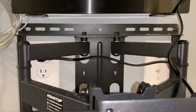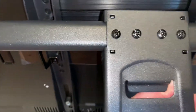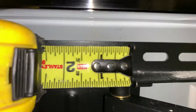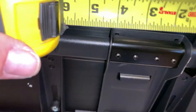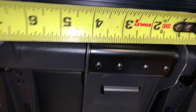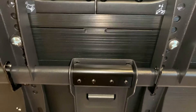I'm going to push my mount off to one side because I want the center of the wall. If I turn it around when I put the mount on, I want it off to the right-hand side — that pushes the TV to the left. Sounds backwards, but if you look at it from the front, it does what you think it does. I'm going to take my tape measure and measure from my wall marking to my center TV marking — about one and a quarter inches. My gap on the back of my mount is six and a half inches, so the middle is three and a quarter inches. Three and a quarter minus one puts me at two and a quarter — so my mount is pretty close to center and I won't have to move the TV once I hang it.